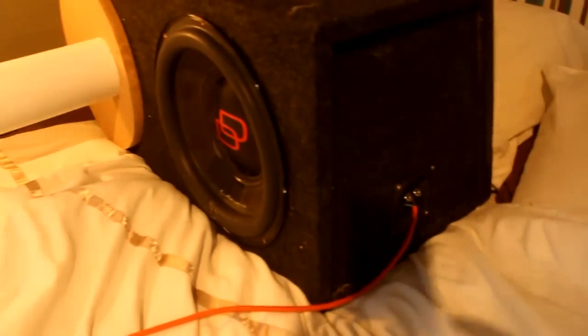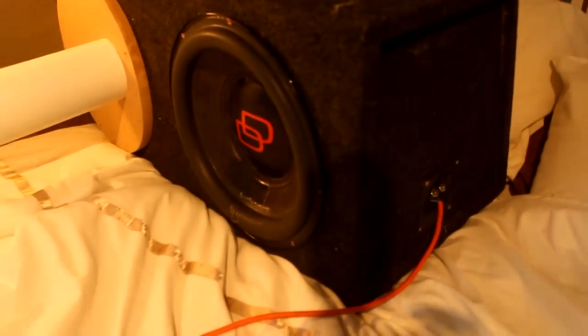The amplifier, which is on, is not that great, to be honest. It's a loudest.com amp down there on a PSU. It's a server PSU, very powerful. I've got another one sitting here as well, so I can parallel them up for some serious power. The amplifier does about 1,000 watts RMS at 4 ohms bridged, which is what this is, a single 4 ohm coil. So this is getting 1,000 watts RMS, and it does do rated, so it's slightly overpowering it.